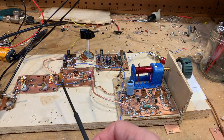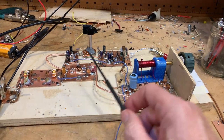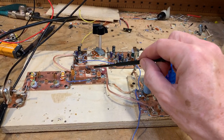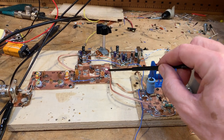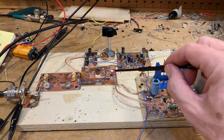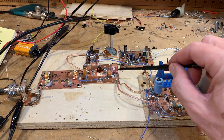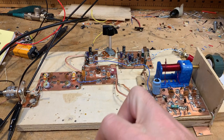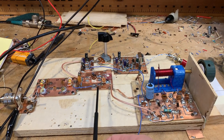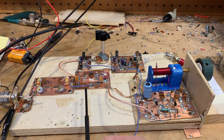The VFO is switching the diodes sequentially — one, then the other. And you end up with a complex repeating waveform, kind of similar to the complex repeating waveform that you get out of the diode ring mixer. This is what produces the sum and difference frequencies, but it's a little bit different from the two-diode mixer that we use.